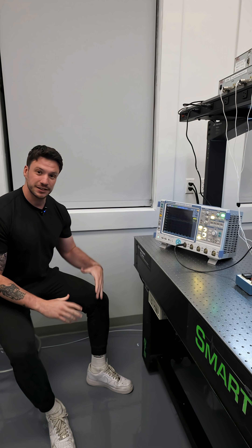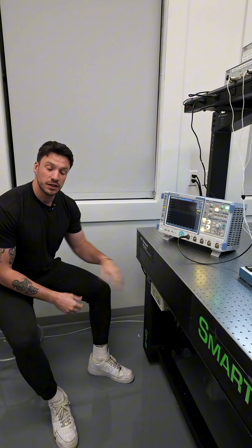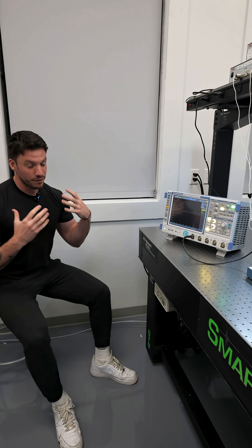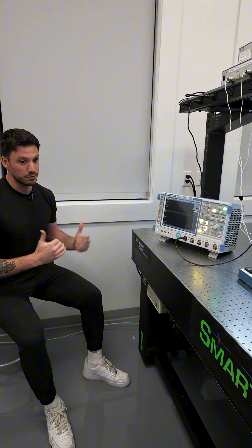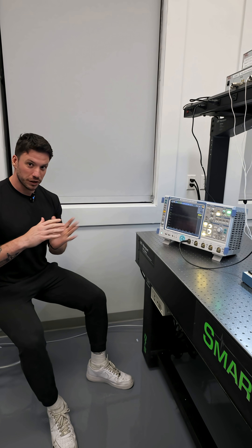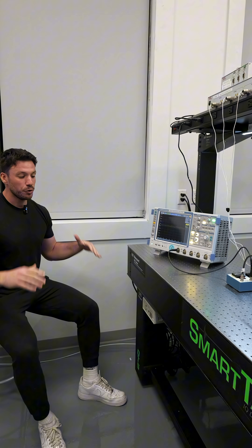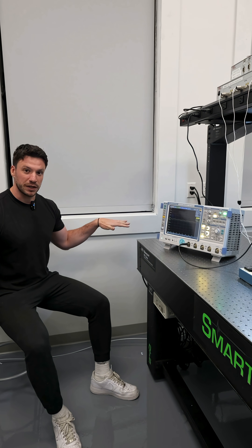On top of the pneumatic legs we provide passive compensation, and we also have some active compensation done through piezoelectric adjustments. This active compensation is very efficient at very low frequencies, though it has a threshold of about two to five hertz — it doesn't work below that but is very effective above it. By combining passive and active compensation, we achieve very good noise cancellation across the full frequency spectrum.